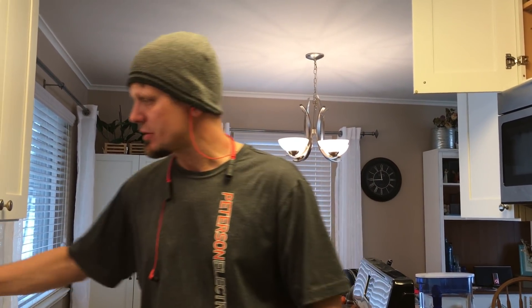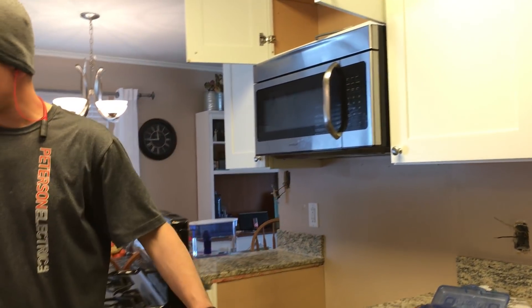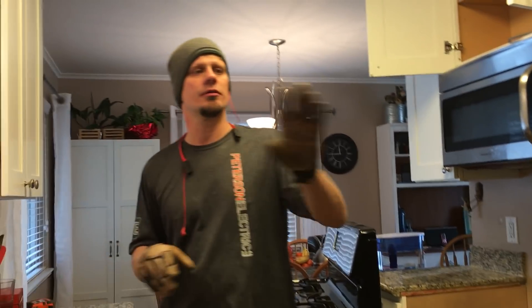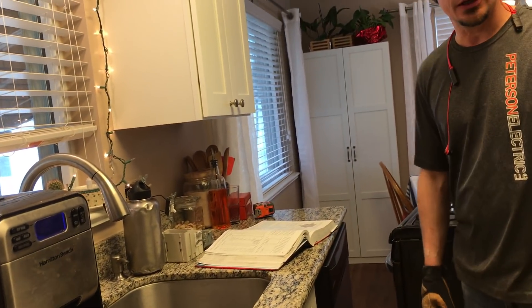The back outlet was added, so what I did there was I found the fridge circuit going from here to this way, separated that, and re-fed the fridge so just the outside plug and the fridge are together. I know that's not the most ideal thing to do but it's going to be better in the long run. Basically this whole wall is now on its own circuit, the dishwasher is separated, and the fridge is separated — all by dividing things up downstairs.